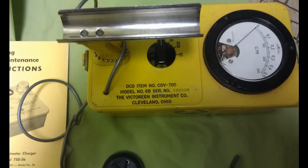To calibrate this thing, set it to the 10x scale. You want it between 1.5 and 2.5, and there's a little adjustment screw on the side you can use to make sure it's calibrated right while sniffing that calibration sticker. Because the scales are 1x, 10x, and 100x, the 100 counts-per-minute mark on the gauge is technically 0.15 — halfway between the 0.1 and 0.2 marks. To make it simple, let's focus on 0.1.